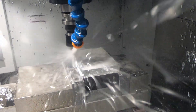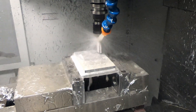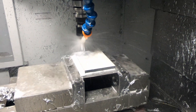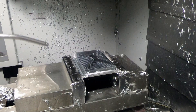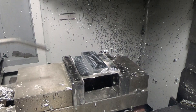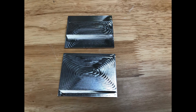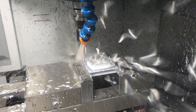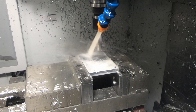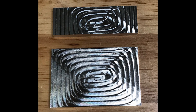After thinking about it some more, I decided to take a different approach: treat the first two operations as milling the stock to size, so I would effectively get precision stock correct in all dimensions except for the thickness. So here I was milling five of the six surfaces for each part. These are the two parts with five sides milled to the correct dimensions — except for the thickness — and ready to have the hat milled off. Once that was done, I flipped them over and milled off the hat, giving me the two pieces of stock at the exact dimensions I needed except for thickness.